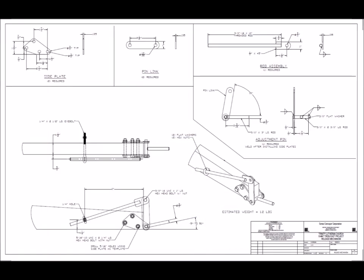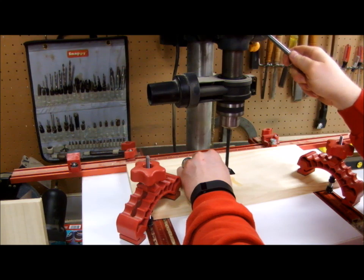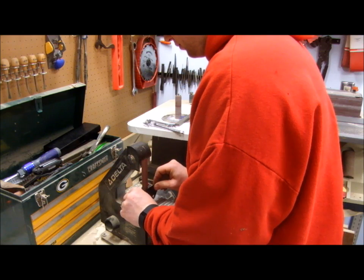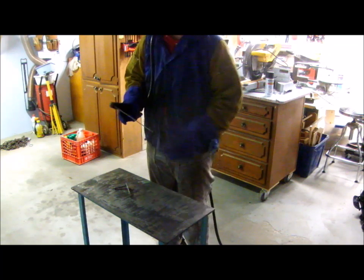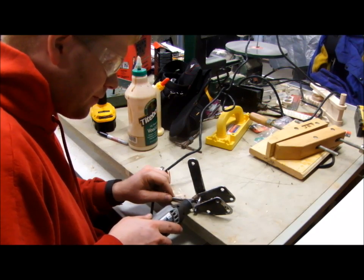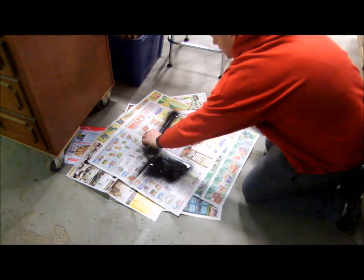The final item that needed addressing was the hook on the end of the arm that releases the sling. I wanted something adjustable so I could play with the release point. Luckily I had access to SolidWorks and a few lunch breaks to lay it out. I started by cutting my pieces and drilling out the holes where the rods were going to go. Belt sanders are a great way for shaping the edges of pieces and taking off burrs. Then I used a hacksaw to cut my rods to length and welded it up. Here I am smoothing out the weld, taking all the little burrs out, and then I gave everything a coat of paint.